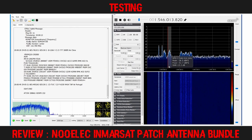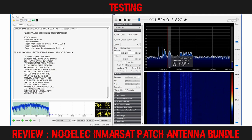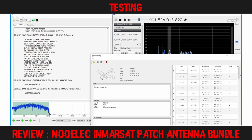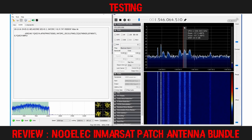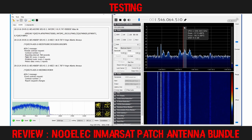The second 10,500 BPS transponder was also reasonably active and provided strong decodes. To the right I could see 5 other high-speed transponders — 2 being the weaker ones at 98 degrees west plus 3 from 54 degrees west. Before trying to decode these, I observed that the plane log had over 60 entries from just those first two high-speed transponders. Rotating the L-band patch antenna a little to the left allowed me to clearly see all 3 high-speed transponders at 54 degrees west. I had not anticipated being able to receive these, and was keen to see if Gqrx would acquire a good signal and data lock.